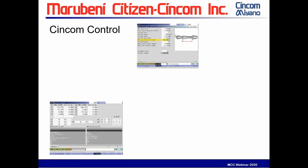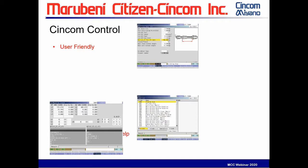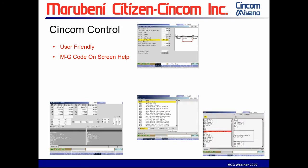So the Cincom control. A user-friendly note here. This is the data page, so anytime you highlight it, it actually shows you a graphic of what it is you're setting, so there's no guesswork. Each one of these sections here will pull up a different graphic picture. We also have an M and G codes on-screen help list, so if you're doing some editing on the machine, you need a code and you don't want to run back to your book, you can just pull it up right on the screen and see what it is, and it gives you a definition.